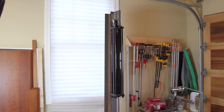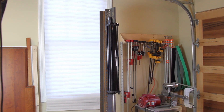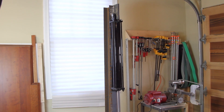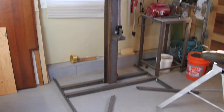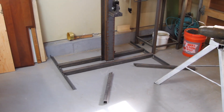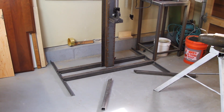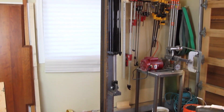I just want to give you guys a quick overview of the progress I made last week. We started off by going to a steel supplier and picking up a pretty decent sized I-beam and a bunch of three-quarter inch plate to build the frame. I also used some tubing that I had left over to make some feet, but these are going to change because I realized I need to raise the press up about a foot, just because it's going to be too low to work under because the cylinder is so big.